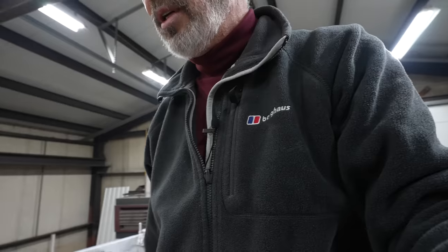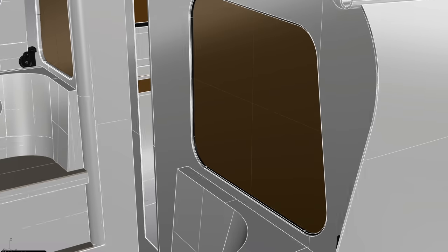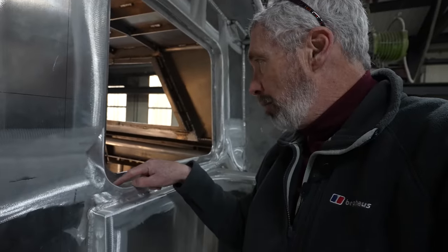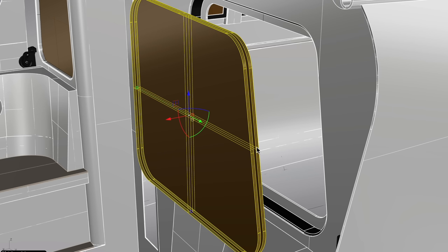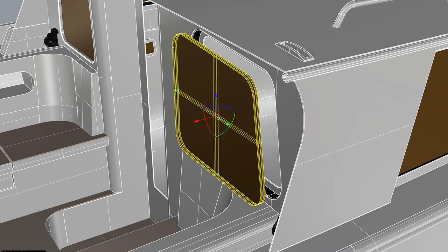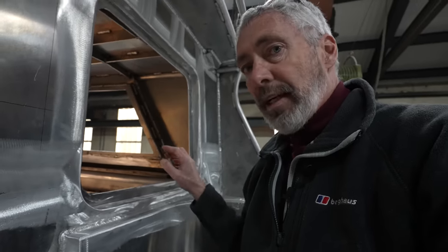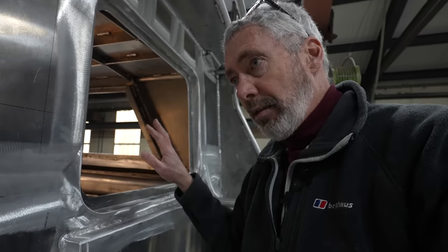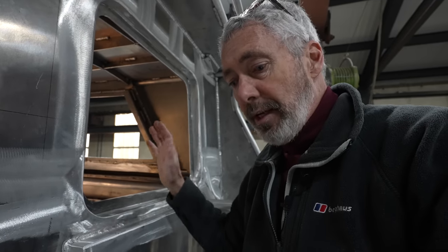The windows are another feature that has to be looked after. These windows will be set in by the window manufacturer, who are the best experts in this. You don't want any water pooling in cracks. The windows are going to be double glazed and set in so they'll end up pretty much flush. The window manufacturer will use a sealant - something like Sikaflex, perhaps polyurethane.